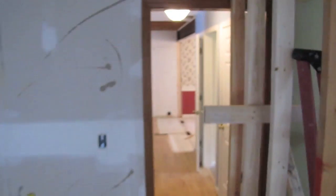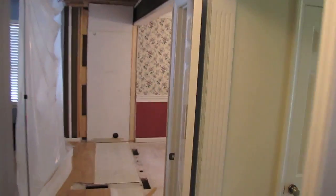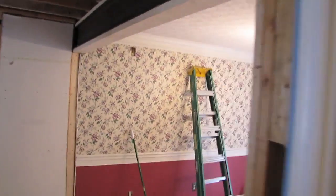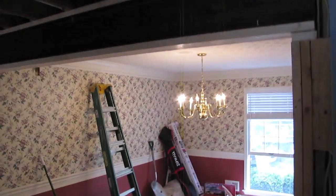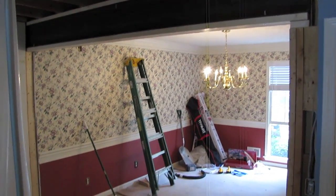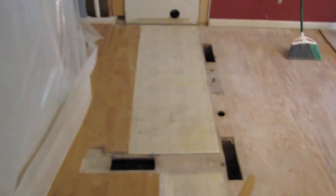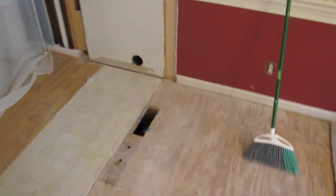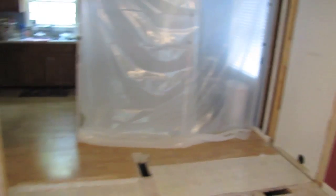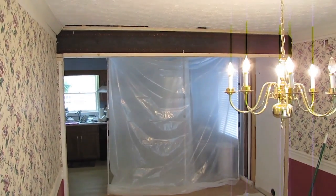While they're finishing up here in the living room setting that steel beam and making a few adjustments, we're going to go over to the next room. Moving into the kitchen and dining area — you can see we put another steel beam in here. This is about a ten-foot span. We took out a load-bearing wall; there used to be a laundry room, you can see in the floor where it used to be. And put the steel beam in.